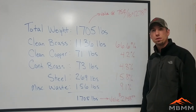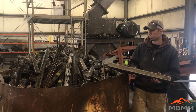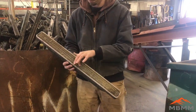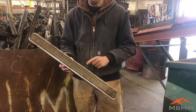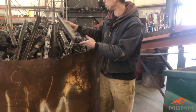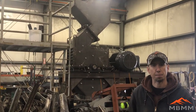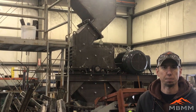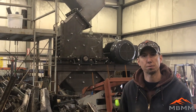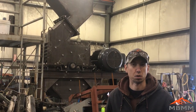Today we're going to be running this whole tub of brass radiator ends. These things have a plastic top, a brass piece where they cut the fins off, and a steel clip that holds them to the plastic. We're going to run them through our hammer mill, which has a four inch screen in it. We're going to bust all that stuff up, run it under a mag belt to pull those pieces of steel off, pick the copper and brass pieces out, and the rest — all plastic and waste — goes into this dumpster.